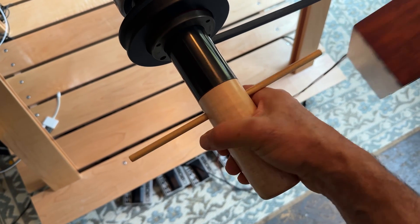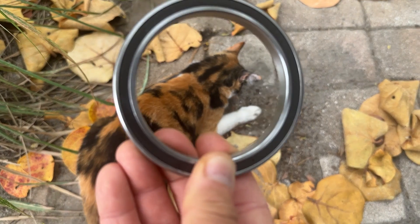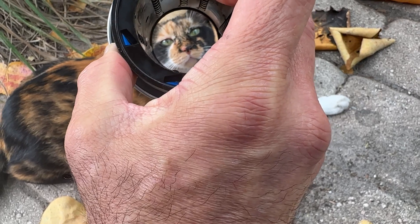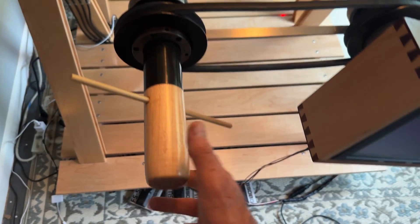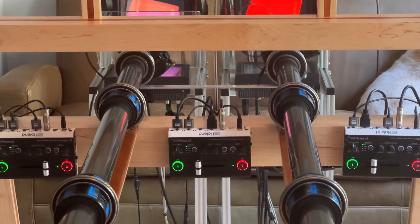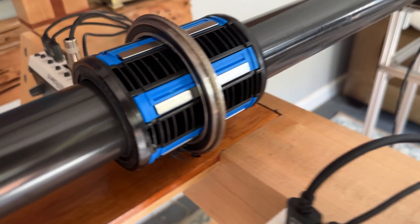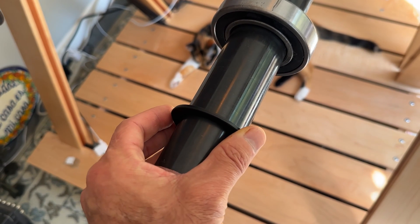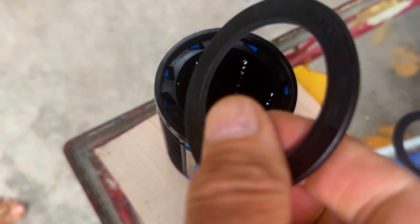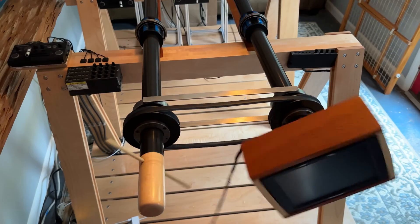So how was I going to get the metal shaft to rotate and also be able to move back and forth? I came up with the idea of using a rotational bearing around the linear bearing, so the rotational bearing acts as the housing, putting just the right amount of pressure so that the shaft can't spin but does move very smoothly back and forth. Then the linear bearing spins within the rotational bearing. Has this ever been done before? There was a small amount of stickiness because the outer seal on the linear bearings made a bit of contact with the metal shaft. I removed these, sanded them down, put them back on, and then the sliding was amazingly smooth and the rotation was extremely easy.